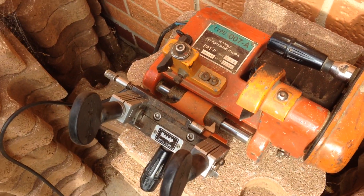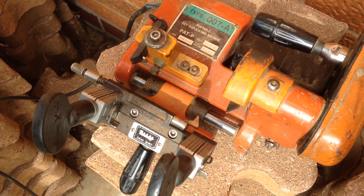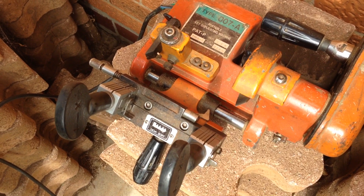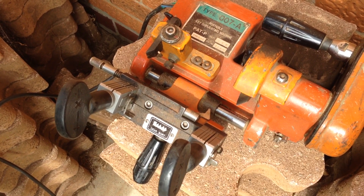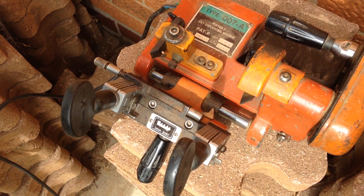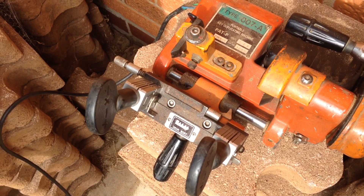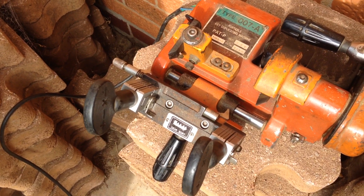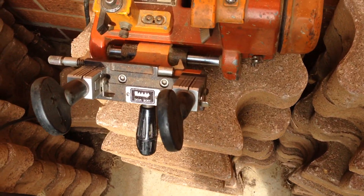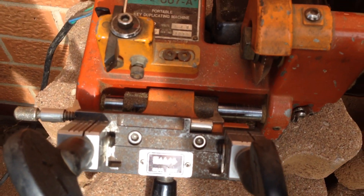Had a backup key — KW — which is not the ideal blank, but it's a bit longer. It shares the same profile. The good thing about it, you can always cut it back from your shoulder, cut the tip off. I've got another one in the reverse profile. It's like anything old — you don't generally keep the old blanks: Toyota 4, Mits 1, Mitsubishi 1Rs and that. They're for the Sigmas, back in the day. That's my little go-to, the one I take out when I'm off-scene.